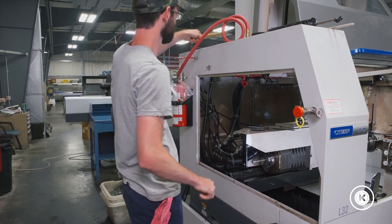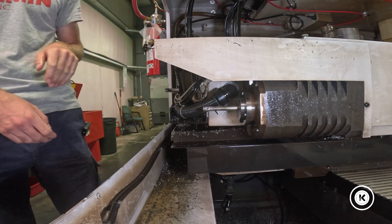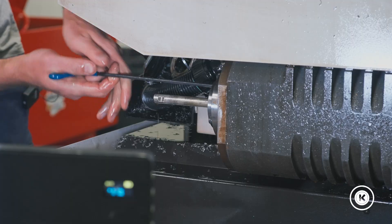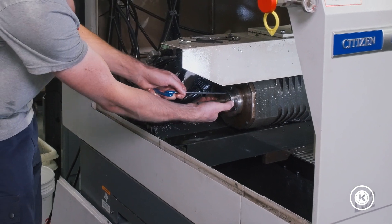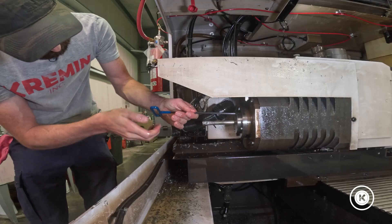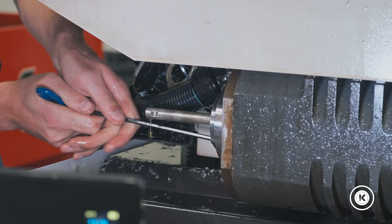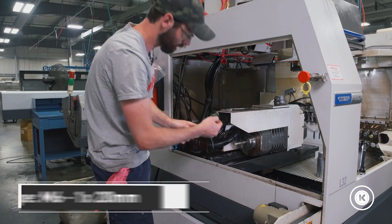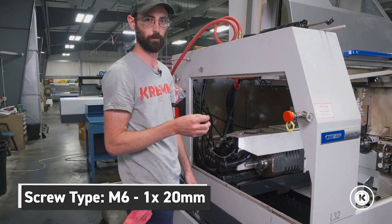So now I have to uninstall it with a hammer. Piece of cake. We'll just take this arm and prop it out of the way for now. And we'll take a 5mm T-handle and loosen these 4 cap screws on the center piece — not the outer ones, the inner ones. We'll take these all the way out. If you lose them, they're just 20mm M6x1 cap screws, nothing fancy.